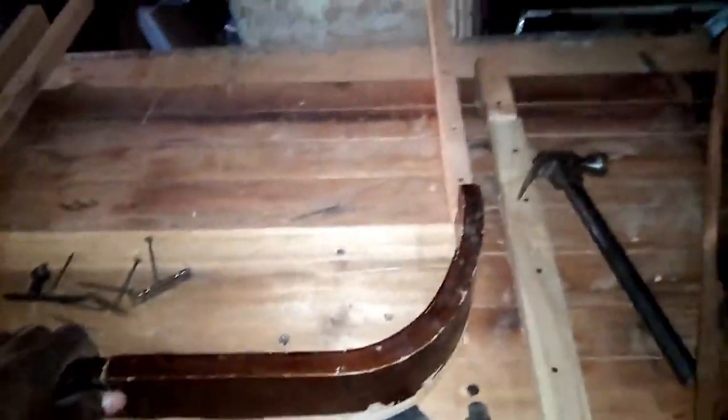So this is the outlet. I'm going to open from here after 30 minutes. I think the fibers would have absorbed the steam. Then I bring it here for bending. I bring the template here, the pieces, the template. Then I bend it according to the template which I made. And this is the template which I made, as you see.